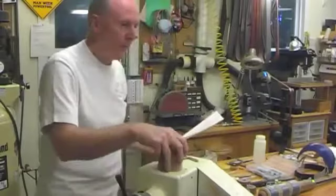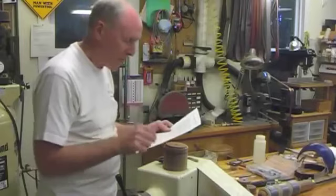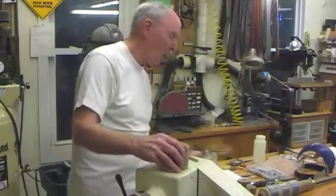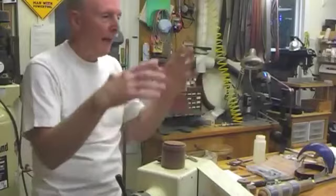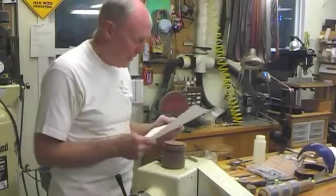But with dry wood, you don't have to worry about that, because you never use a chuck if it's slow enough. Then part the waste block from the bottom. Shape the vessel, leaving wood for support at the top. Leaving the waste block on gives you support from the tailstock, which is important, especially if you have a long piece, and it'll make your turning more concentric. You'll get a better job with the tool because you'll have less vibration.